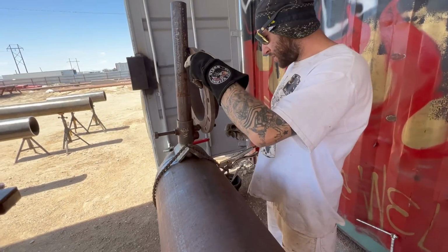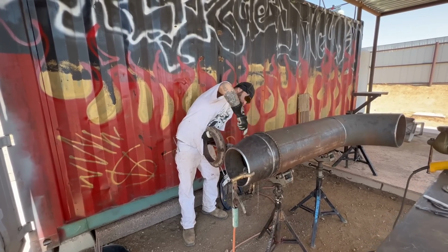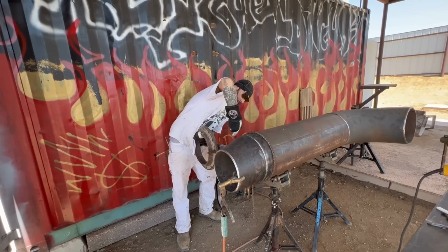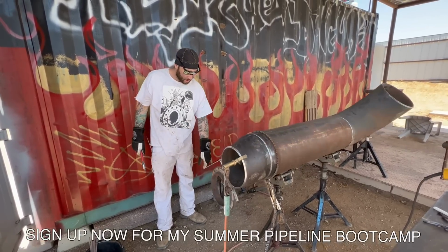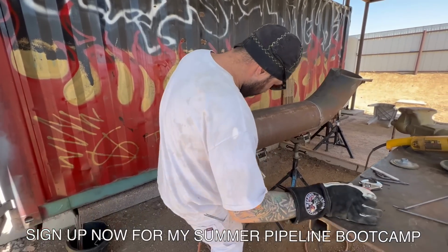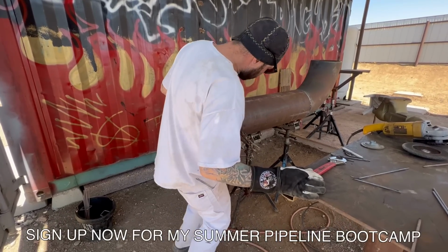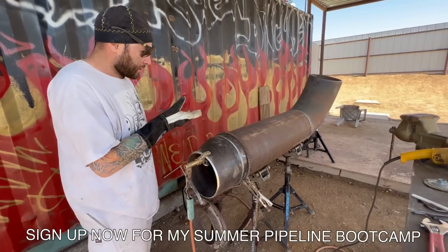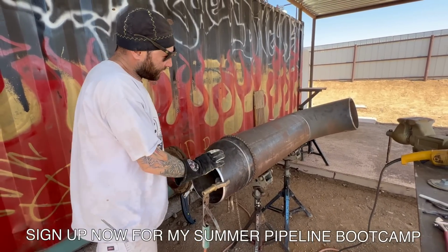Use this as my counterweight. And at this point now, this counterweight should counterweight this piece to roll that weld out nice and easy. See, it's going to hit my jack, so I got to move my jack. Just enough. But look, now I shouldn't have any problem rolling it. I should be able to roll it nice and easy over there. Get a good rollout weld.